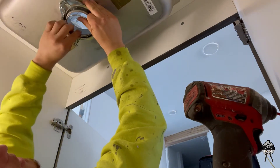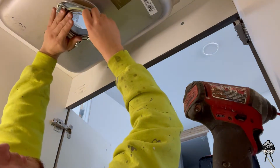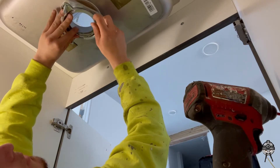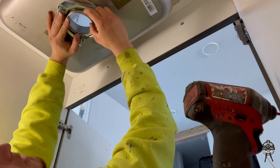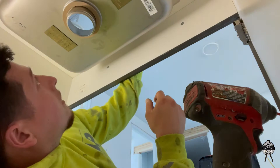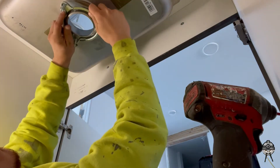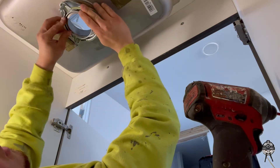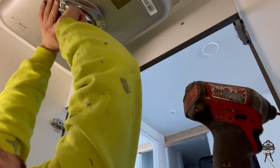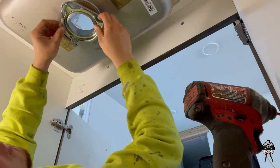You need to get the ring open and get it in there. That's why it's important to push the top down firmly into the putty — so this won't move. If you push right here, it's all going to go up. You gotta open it like that. See, it already moved on me — if it keeps moving I'm not going to be able to do it. I press down as hard as I could. Again: triangle piece in, screws up, then the ring. Try not to put a lot of pressure on the middle part or it'll go up again. There you go — it's already locked, it won't come out. This is probably the hardest part of the whole job.